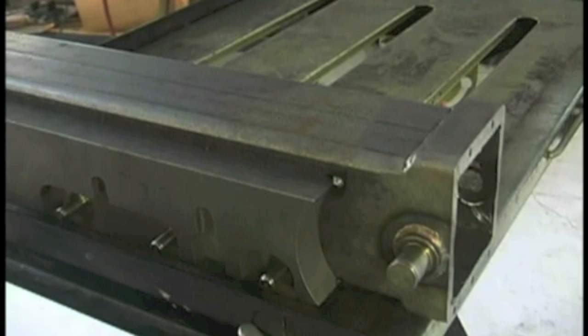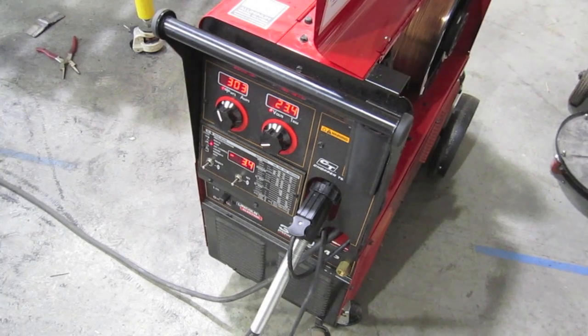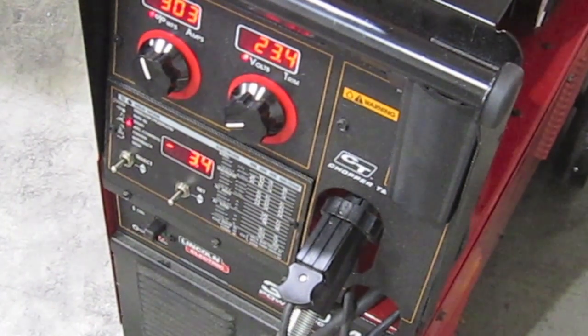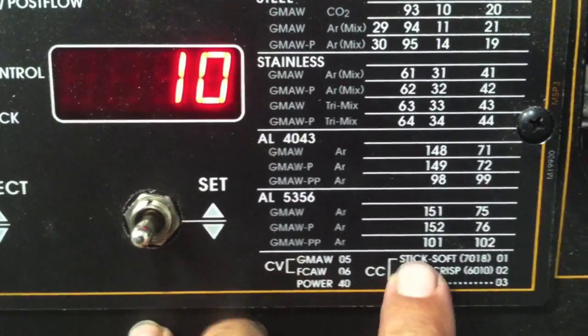So it's always good to have a stick welder in a shop, because you never know — your MIG machine might tear up, you might run out of gas, you might run out of wire, poor planning and all that good stuff, but things do happen. In order to get a part out, you can always rely on the good old stick welder if you've got a box of 7018s or 7014s that you can make look decent.